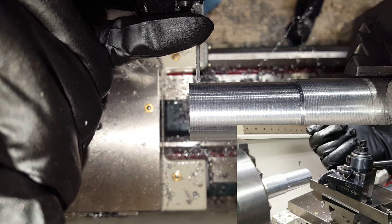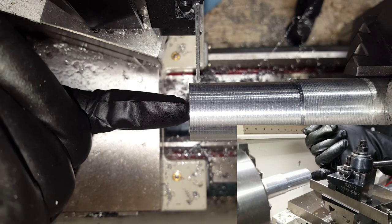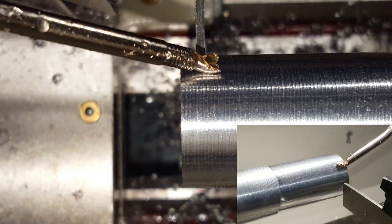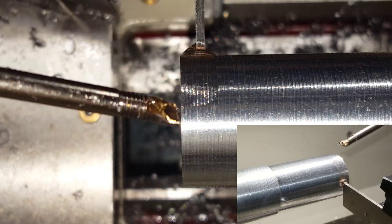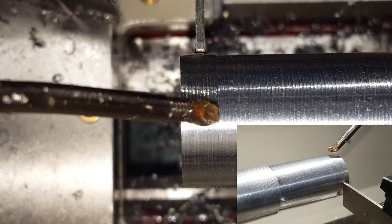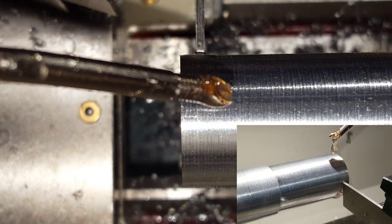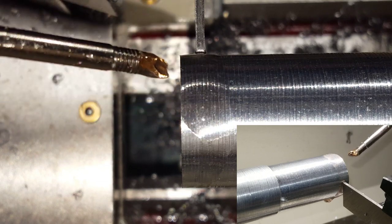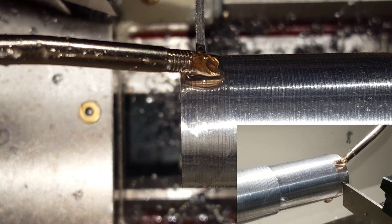The top surface of your cutting edge needs to be at the direct center of your workpiece. Now that I'm about to begin turning I'm going to put a drop of lubrication right here and continuously apply lubrication — I'll hold the bottle right here and apply a constant supply. This operation requires a lot of lubrication; it puts a lot of force on your workpiece and is very hard on your motor.